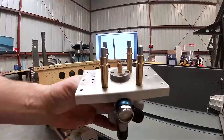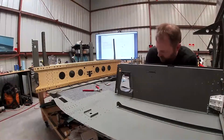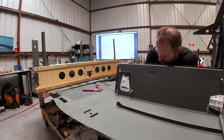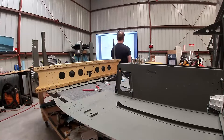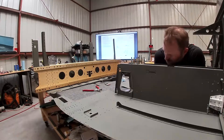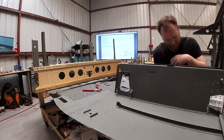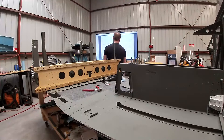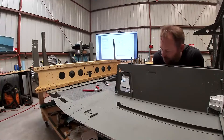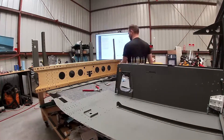This is what the notch looks like that I filed in there. Now I can be sure I'm not going to cut a hole in that valve just by flying the plane, and I won't have fuel spray in the cockpit and cause me to die. Next up, I have this fuel valve in a configuration — I don't know if this is the final configuration — and I have to start playing around with figuring out how the fuel lines are going to work. So let's get out the flaring tool and figure out how that works.